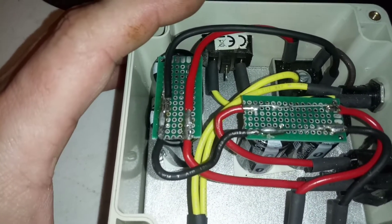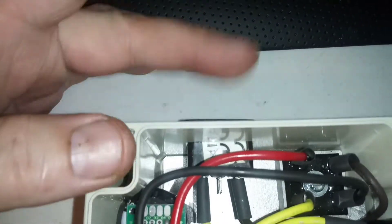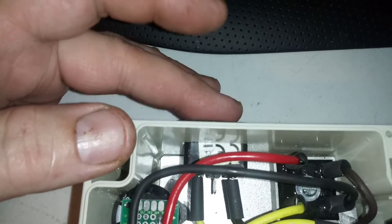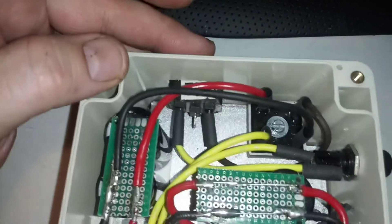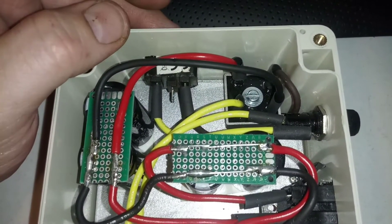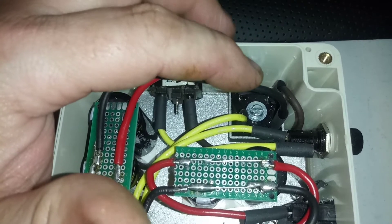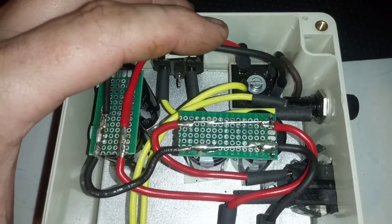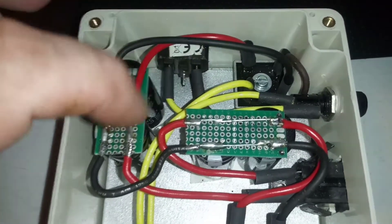Because it's going to depend on the voltage being used. This is the input from the wall outlet, but it's not going to be coming in from the wall. I have a variac on its way — a 30-amp variac — and that's going to allow me to adjust the voltage. The AC voltage in, and in turn, that will adjust the DC voltage for me. So I can bring that down from 120 volts to whatever works. Bringing that down, I think we're going to need the extra capacitance.